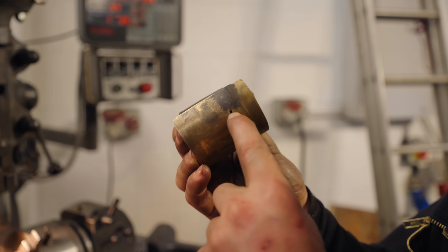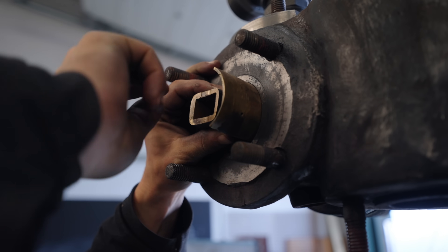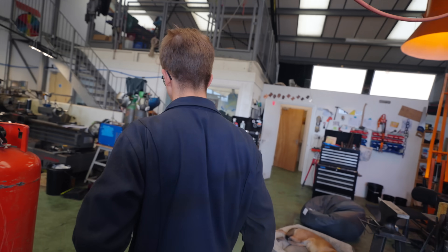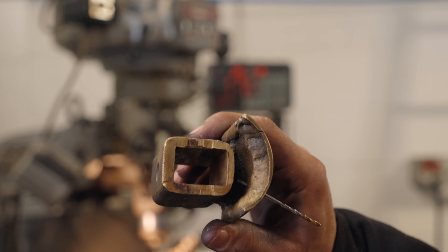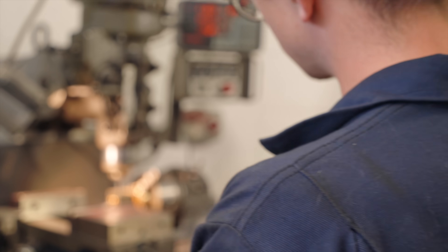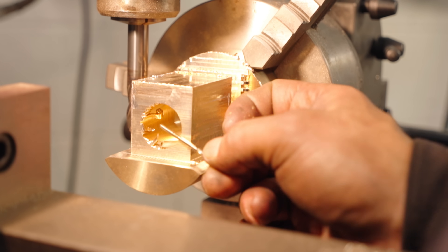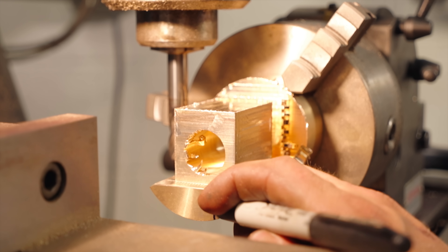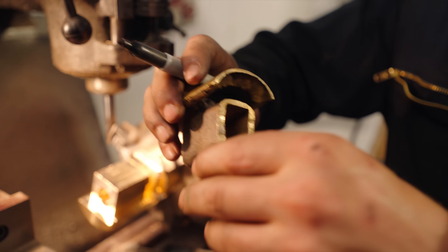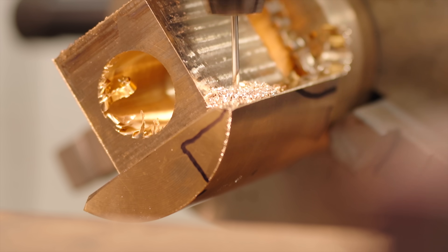This has a hole in it, and I presume that is so that when this is in the shut position, there will always be a trickle of some pressure and a trickle of some oil into this valve assembly here. Presumably that hole is very critical — we've got to put one in ourselves, so we've got to work out what diameter it is. Notice the design on this valve piece: it's hollow back here, which means it can just go straight in. But on ours, there's not going to be any relief pressure to get through until we get into that hole, which is going to be filled with a bar. So I think I'm going to have to drill in some sort of a dog leg — drill one direction, then come in 90 degrees and drill the other direction. Actually, I don't need to do a dog leg — I could just drill the hole at an angle: put the drill bit in here and just pop out right there. We're through.